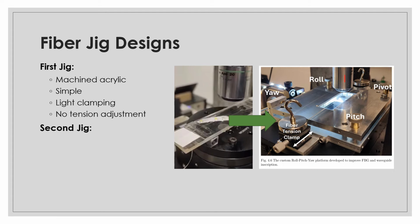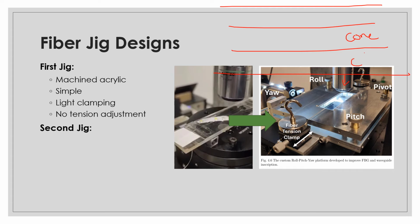When you're looking through the microscope, what you see is here's the core and here's the cladding. If the laser point, let's say, was put here, you could move this 20 millimeters, and our walk-off might be in the nanometer range or less. Sometimes you get it right on the money and it doesn't walk off at all. So we're holding tolerances of say plus or minus 200 nanometers across 20 millimeters of traverse distance. So we can write arbitrarily long gratings at incredibly high precision along this core.